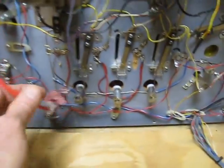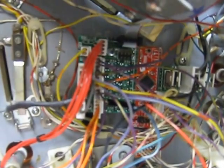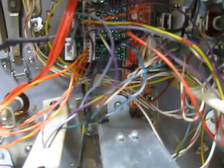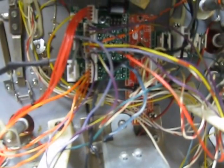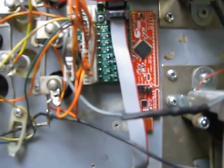This takes the 4 wires and goes up to the first OPP board right there. On that OPP board, we have 2 wing boards that are incandescent boards, a solenoid wing board over here, and an input wing board there. From there, we use this ribbon cable that goes to the next one, over the drop target solenoid. That one has 1 solenoid board, another incandescent board, and 2 input boards. Then we keep going down the chain, another 2 incandescent boards, and the last one in the chain, which has 1 incandescent board, a solenoid board, and 2 input boards.